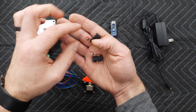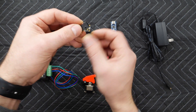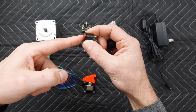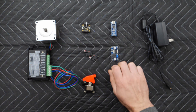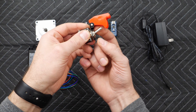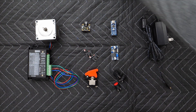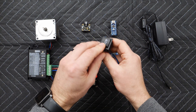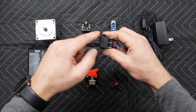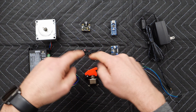These are known as limit switches. They have a lever that acts like a switch when pressed and either opens or closes the circuit between two pins depending on your application. These three buttons are momentary — when you push them, they make a momentary short between the two contacts on the bottom. And last but not least, this is what I like to call a missile switch — it's actually just a regular two-position switch with a cover — and we'll be using that for power into our system. There's also a momentary rocker switch with two positions that centers on zero: when it pushes down it makes connection between two pins, and when it presses up it makes connection between the other two pins.